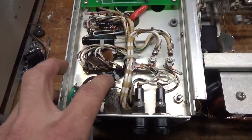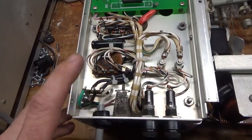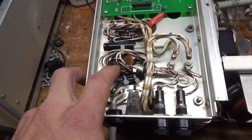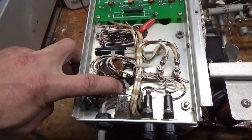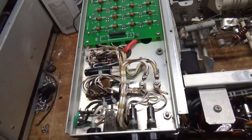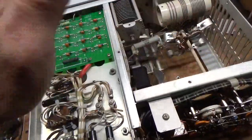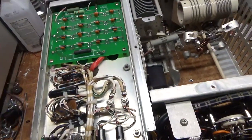Now this is all set. I also zip tied these wires — when I disconnected it, the wires now go from here to here. I touched up these solder joints and the solder joints on this board. This line wire was actually touching the B positive point here — this is a crowbar, a high voltage interlock. If someone takes the bottom or top cover off, it puts a dead short on the B positive to protect the owner so they don't get electrocuted.